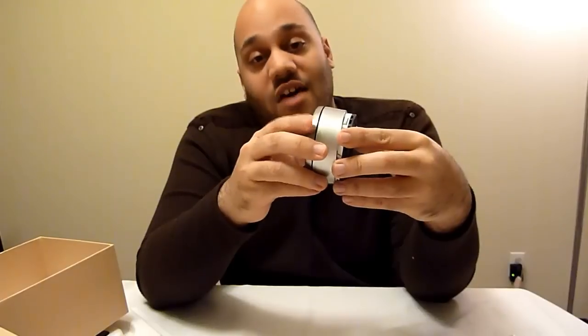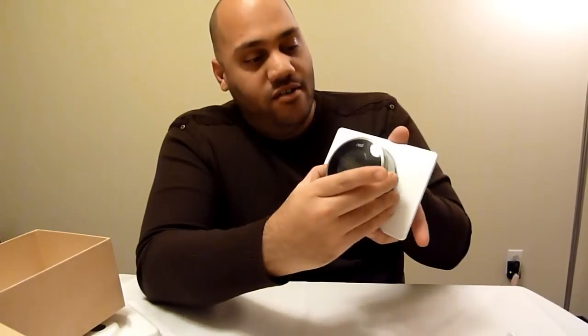Once the backing plate is against your wall — either directly or in a mounting bracket — you connect the Nest into it and you're done. Before you start this process, make sure you turn off the breaker for your heating and cooling system — you don't want that on while you're doing this. Once it's installed, turn the breaker back on. The Nest will power up, boot up, and download any updates over the internet after you connect it to your WiFi network. Then you just let it learn — it takes about a week to learn your habits, and once it has them down it'll start going to work, adjusting over time. If it's not doing what you want, just use it normally — turn it up, turn it down — and it'll adjust its behavior based on your usage, always aiming to save you some money.